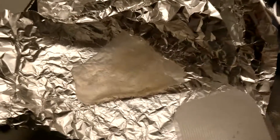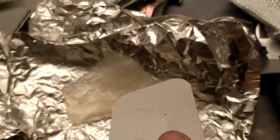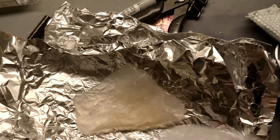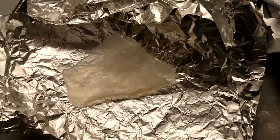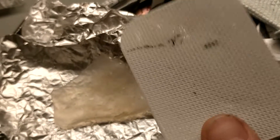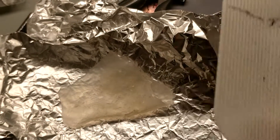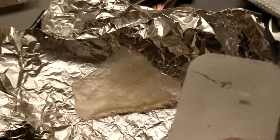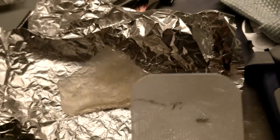The only problem with that is that PLA is very hydrophobic — very non-polar — whereas starch, or TPS, is very hydrophilic; it dissolves in water quite readily with some heat and stirring. Something that can be done about that is to use what's known as a surfactant. In layman's terms, a surfactant is a substance that makes it easier for hydrophilic and hydrophobic substances to mix. An example of a surfactant is soap, which is why soap is good at cleaning up dirt.